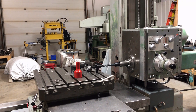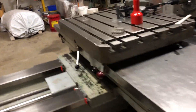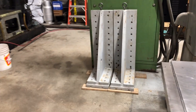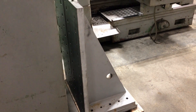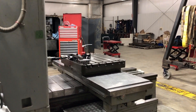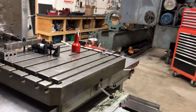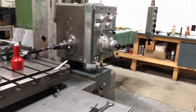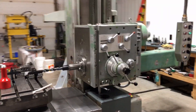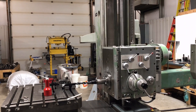and it will tell you how much the square is out and how much your column is leaning. This machine came with two angle plates and I didn't know if they were square, so I picked one, mounted it on the table, and used GNL's method. I found out it's about six and a half to seven thou out of square - but that doesn't matter when you use their method. Supposedly you can still use it to check the squareness of the column.